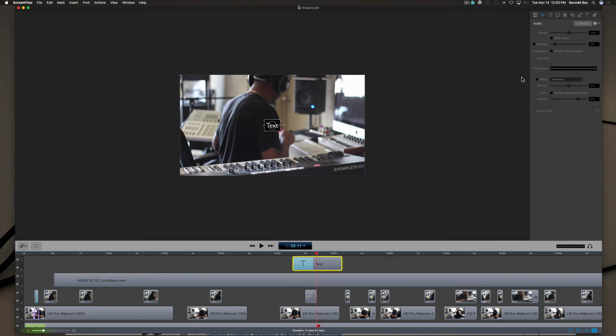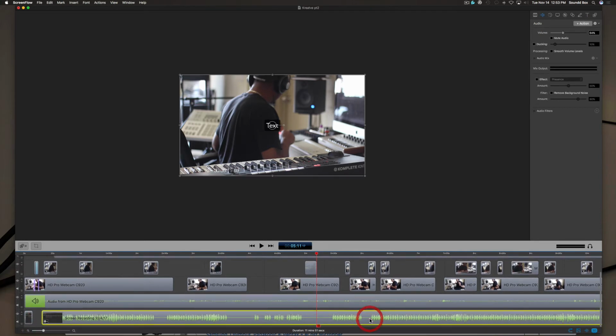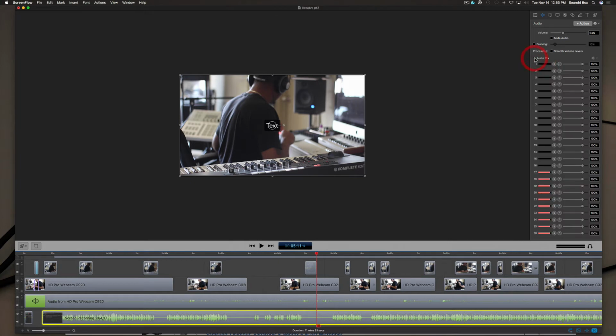The audio that's coming from the computer itself is down here, and it's pretty much stereo. And you click this audio mix button here, and it allows you to see what's going on. All of this is just interacting with what's available in the PreSonus 192 mobile, this interface I have here. But in most cases, you'll only see two here for left and right. So that's really only my concern. Just make sure that the left is left and the right is right. And just make sure that this is corresponding, because sometimes it'll be like dead center down the middle, but that might not be the case. They have fixed that in the past.